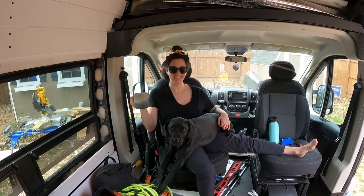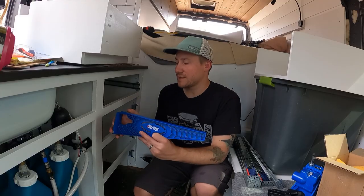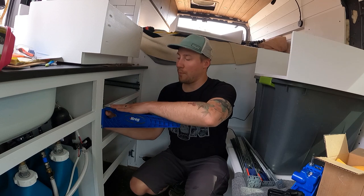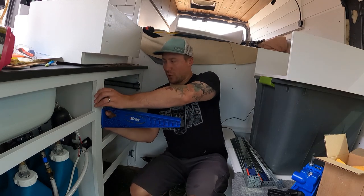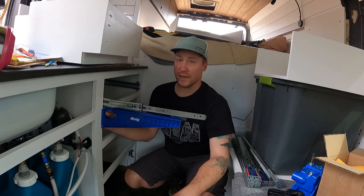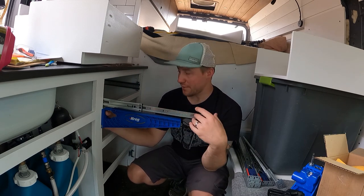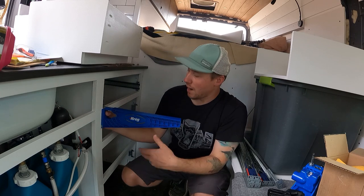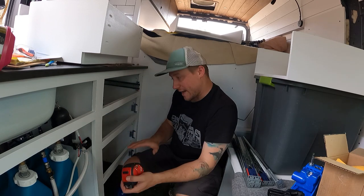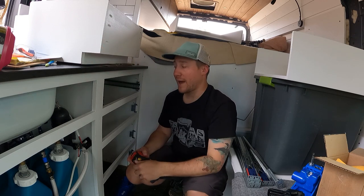I'm helping. So is Francis. You're doing a good job. One way to utilize these — you can flip that tab out and clamp it to your face frame so that you put your box on top of it, and when the drawer slide comes out you have a spot where you can just drill in a couple of the holes into the side of your box and it should be perfectly level. But because we have this wall here, we won't be able to do that. So instead I am going to take out the drawer slides and screw them onto the side of our cabinets ahead of time.